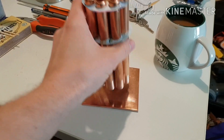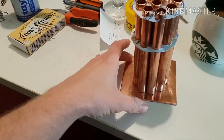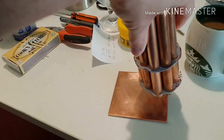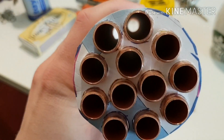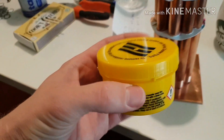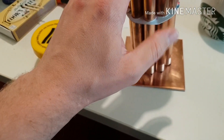I've got my copper pipe prepared for soldering. I've cut a notch at the top of each pipe — that's to let the air inside escape. If this thing is soldered onto the plate and lowered into the thermos, the air needs somewhere to go or the liquid won't fill the pipes and it won't cool efficiently. I've also sandpapered the ends clean to make the solder stick better, deburred the ends so people don't cut themselves, and roughened the surface to remove corrosion.